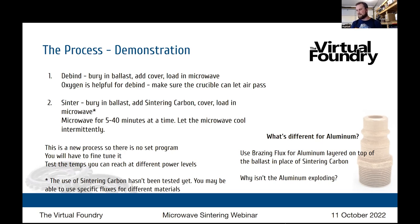Because if you do a 30-minute time, even if the kiln isn't heating up, it's the elements on the inside that radiate out. So the thicker walls and more supporting ballast help dissipate that. In between certain longer microwave cycles, I have a portable fan, which I put in front of the microwave to cool it down quicker, while the kiln itself sits sealed just outside of the microwave. Any time you want it to hold at a temperature, it only loses temperature at a certain rate, and if it's sealed up, it holds that temperature pretty well. So it can sit outside of the microwave without being bombarded by microwaves for a while, maintaining a certain temp. I've noticed that's been working, at least for aluminum.